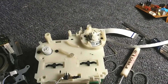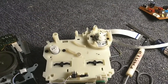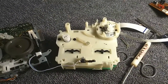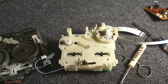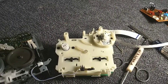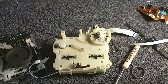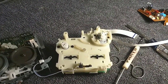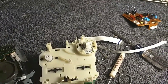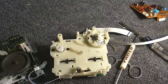The primary symptoms of a cracked gear: it doesn't cycle - you'll hear a click, the motor will spin, and that's it. If it does manage to grip enough to cycle, you may notice the reel table stops moving and it will try to eat your tape. A classic symptom of this gear beginning to die is that when you go from play to stop, the supply reel will turn counterclockwise really fast and unwind your tape in the cartridge. You want to change these gears out - they're all going to die. Just do it. It's not cheap, almost $30 including shipping, but it makes the set work.